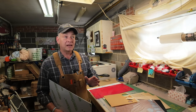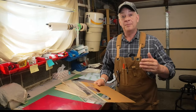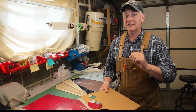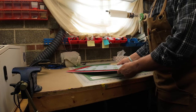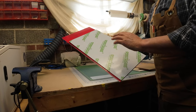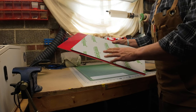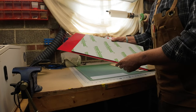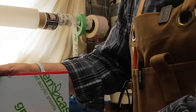One thing I've found that's kind of consistent across all three suppliers is that although the overall quality is reasonably good and maybe towards high, the cut quality is not often very consistent. I'm just about to start working with colored acrylics, so I ordered a number of different colors from one supplier. They're supposed to be quarter sheets, so 12 by 24. But keep in mind that just like on the laser or anything else you do in the workshop, you're never going to get exactly 12 by 24 — you're going to get probably 11 and 7/8ths or thereabouts by 23 and 7/8ths, because remember there's a kerf every time they run a saw through the material.